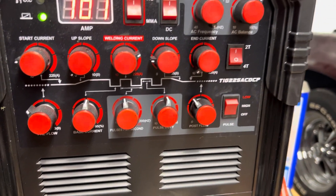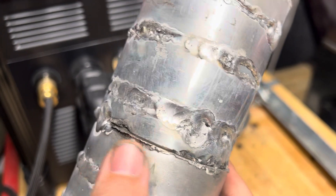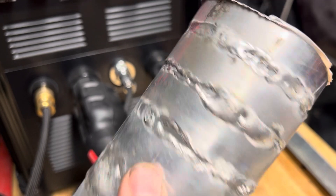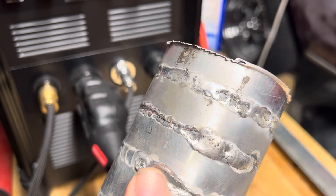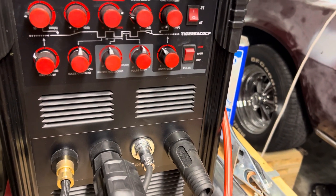In my experience, when I had the frequency at anything around 50 or so, the heat was getting distributed too far. On really thin aluminum I was getting stuff like this — where it was really caving in, real bad. You can see it's really caving out here on the outside, and I couldn't really get the heat to focus in on one spot. Same thing kind of right there.